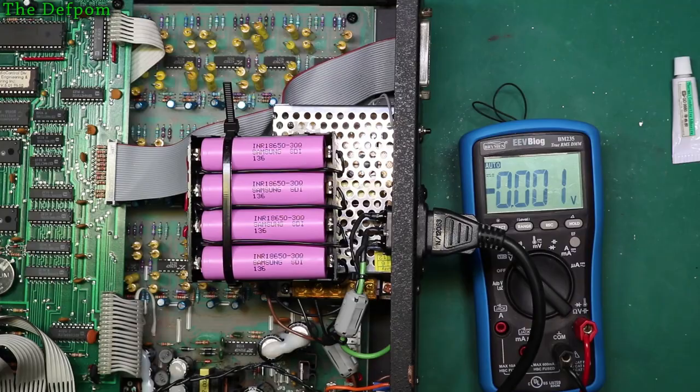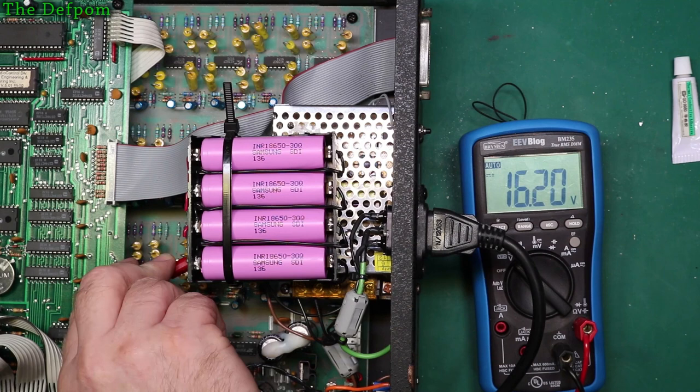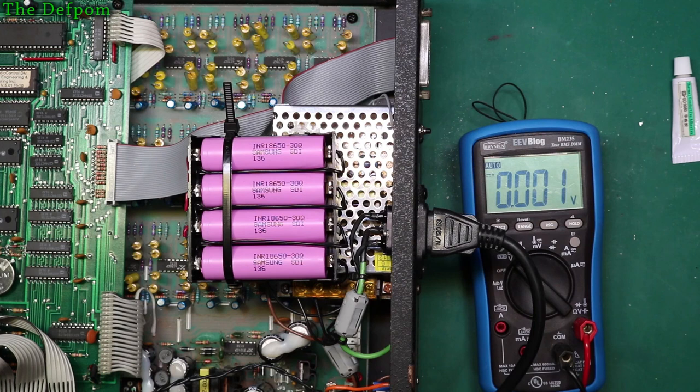So on the battery charging, let's see. Charging side there, if I can get the probe to touch, so there you go. Oh, 17.3 is slightly lower. 16.2, so it's gradually coming up, which is exactly what I'd expect to happen. So that's 1.1 volts across 4.7 ohms. What's that, 250 milliamps or so would be running through that resistor. So the current's also dropping down as well.